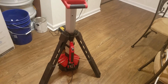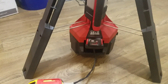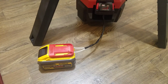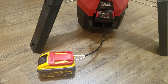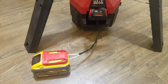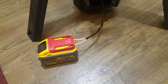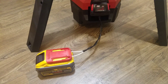Now, I don't recommend actually doing this for a couple of reasons. First of all, the Milwaukee battery has a chip in it, as opposed to the DeWalt tools which have the chip in the tool and the battery does not. So if the tool needs to shut down for any situation, this will not work and could potentially ruin the battery and the tool. Also, I don't know about this for sure, but it is possible that you can over-discharge this DeWalt battery. And then you would have a problem charging it back up, so you have to be careful not to discharge it too much.